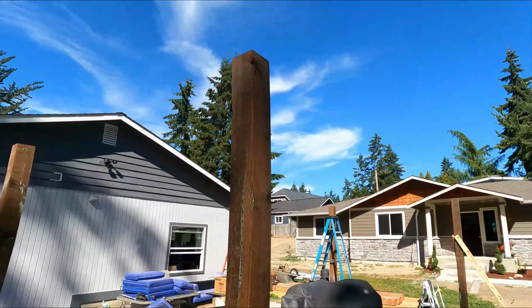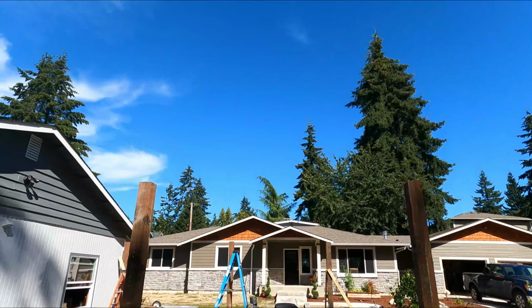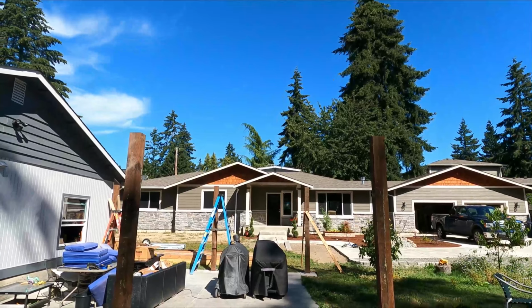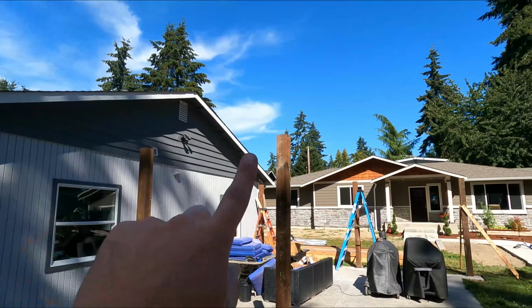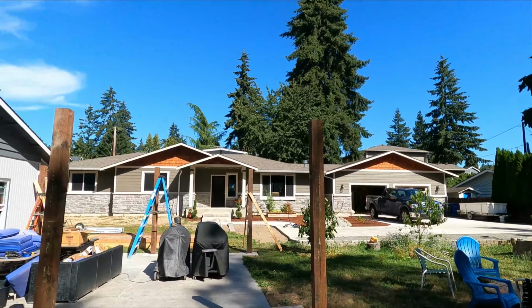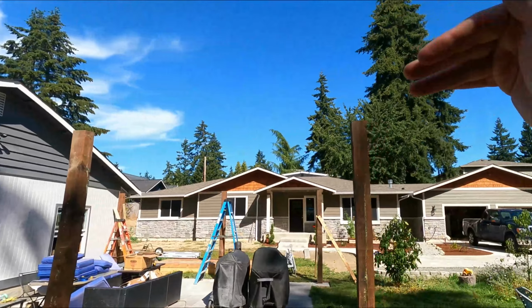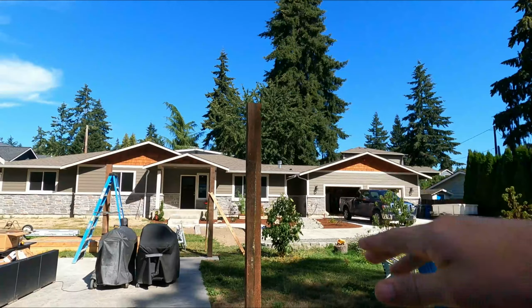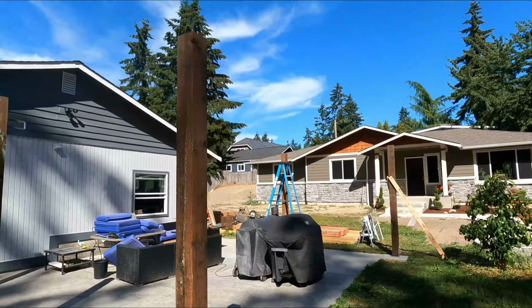And then the beams that go this way, they're 12 feet long, but will be cut down to size, right? So you have a lot less, and then you have 1, 2, 3 posts holding it up. So ultimately, it's going to get you a little bit better structural connection by running them the other way.